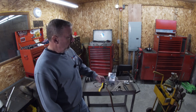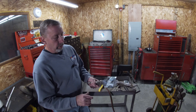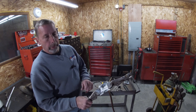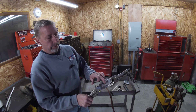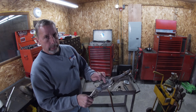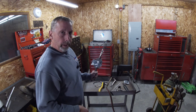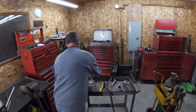These are just some scrap pieces here. I'm going to start off with running a bead of brass across here. We used to also plug weld with brass, and if you got lazy and didn't want to punch your holes or drill them ahead of time, you'd take the torch and heat a spot up — it would get pretty hot and blow a hole in the top panel — then heat the bottom panel, melt the brass in there, and fill it in. Kind of a lazy man's way of doing a plug weld. I'll show you how we used to do this.